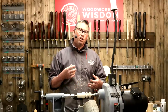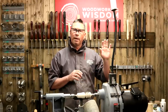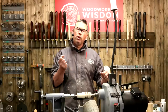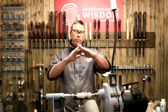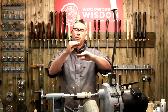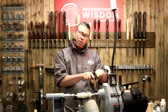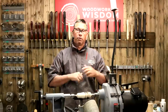Mechanical, you're changing the speed of the main shaft alone. The motor speed is constant. Generally, it's about 1400 revs of motor speed on a mechanical variable speed. And when you move a lever, you're moving pulleys. Pulleys intertwine. The lever moves the pulleys like this, and in between the pulleys runs the belt. So the belt then raises and lowers with those pulley movements. So that's how you get the main shaft changing speed without the motor changing speed. So that's the difference, mechanical and electronic.